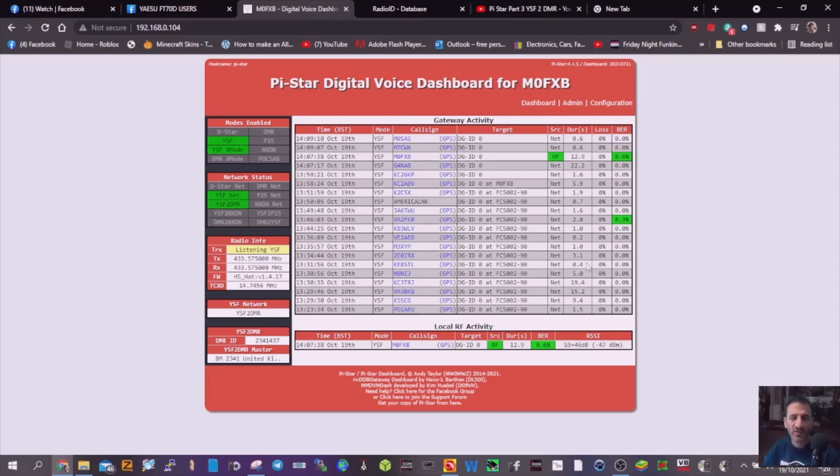You can see the way it's all lit up here with the dashboard. It doesn't reveal too much information. Look, we're using Brandmeister here. I've got my self-care password in. That's just my frequency of my hotspot here on the left. And then, look, you've selected YSF to DMR. You could also select DMR to YSF, and there's other things you can do as well. Pi-Star has already started to update things regarding cross-moding. You can actually control these links using a radio like the FT-70 or FT-3.